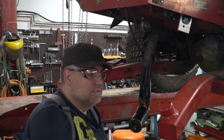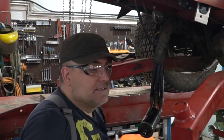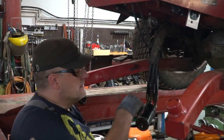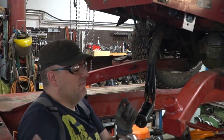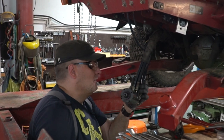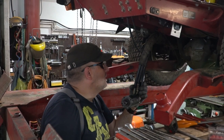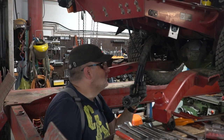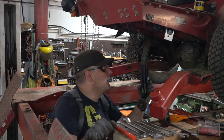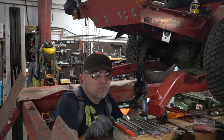And the way we somehow got that fault finding is that we got a round piece of thin copper, I guess it's this one, or it can be that it's this one. Since these are O-ring seal fittings and I don't have any of them, we just block the tank line for hose fitting here and carefully try to lift up the cutting unit. And simsalabim, then it seemed to be working, but we didn't have any courage to play more with that, so it was just a 1 second tryout and diagnosed by that. So fingers crossed.